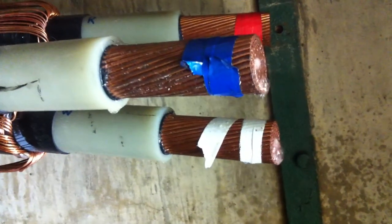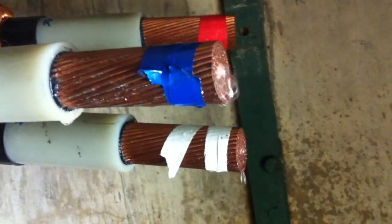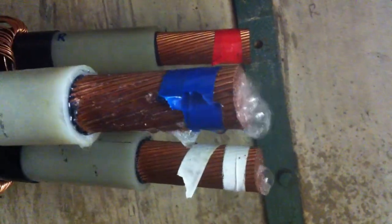If you could bubble nitrogen into there at a constant slow rate — it's only got to be about a bar and a half — it stops any water coming in, and anything that is in there it'll slowly get rid of it. Probably once a year during shutdowns you could actually crank it up a bit.